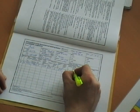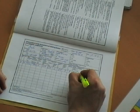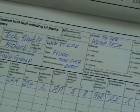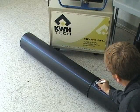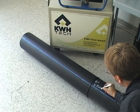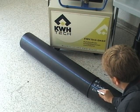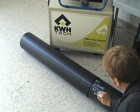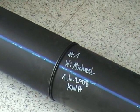Fill in the protocol with all relevant and requested data after the welding and during the welding as far as possible. You demonstrate your responsibility with your signature. After each welding, write on the pipe with a white or silver marker: the number of the welding, the welder name, and the date. It is not only following the rules — it is quality assurance.